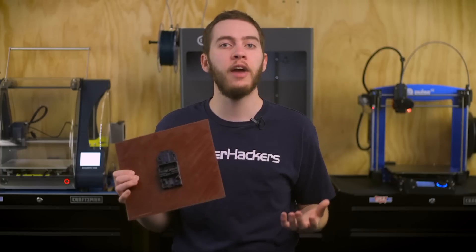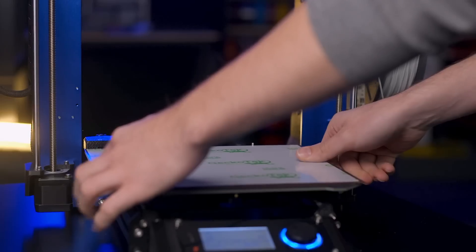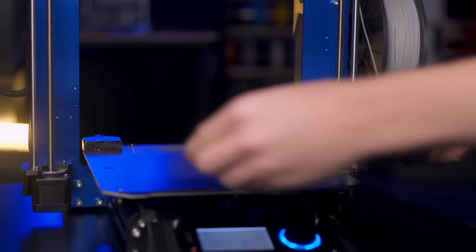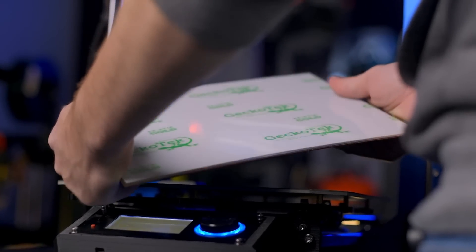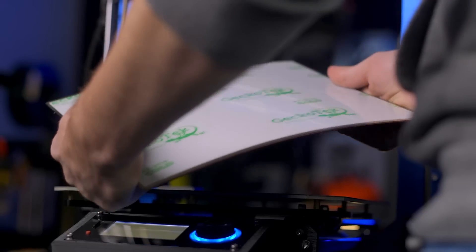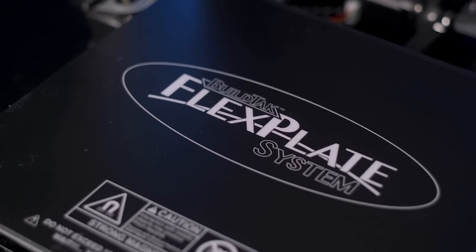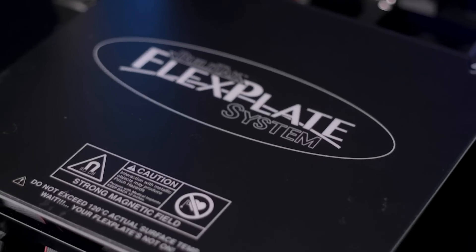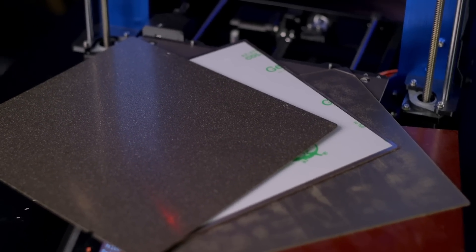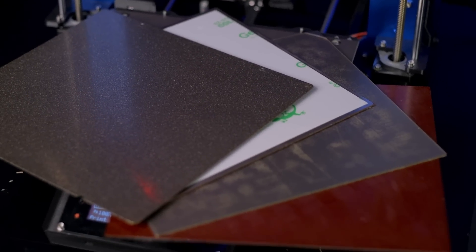With so many flexible build plates available, you should definitely be able to find one that fits your workflow and 3D printing needs. Flexible build plates are a two-factor improvement for 3D printing — you can easily remove finished 3D prints or swap build plates in seconds. By using a flexible spring steel sheet as the build plate, you can twist and flex the sheet the moment a 3D print is finished to pop it off and get back to printing. A magnetic base plate is semi-permanently installed to the heated bed using an adhesive sheet, which means you can swap spring steel build plates depending on the conditions needed for a specific filament.